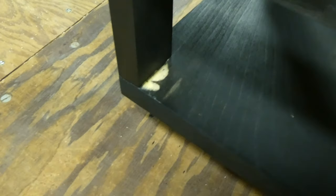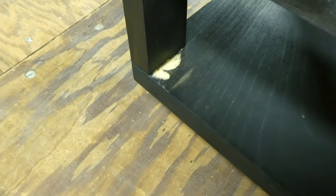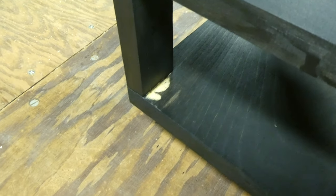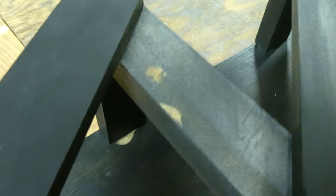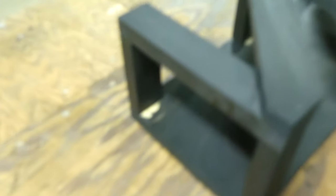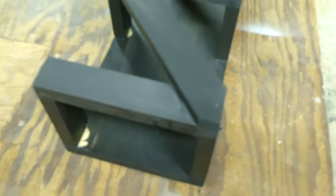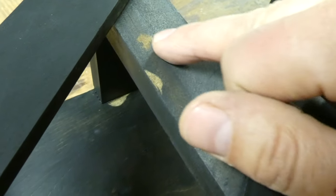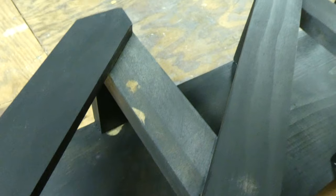As you can see, we have some imperfections here. I guess I didn't wipe the wood glue in time, and the stain couldn't penetrate, so we have this weird glob here. And then up here, I think there's a similar story — I don't know if that's wood glue or what. And there's another one down here. What I'm going to do — I could sand this down and then restain, which is perfectly fine. Or I could add some character to this and kind of chip out these pieces. I think I'm actually going to do that — take my chisel and just kind of chip this out here, maybe indent that there, and see what kind of character that adds.